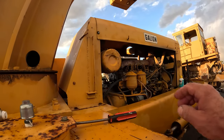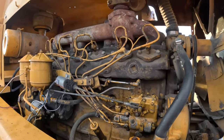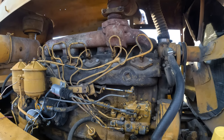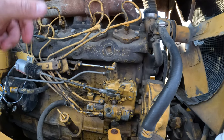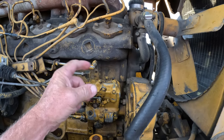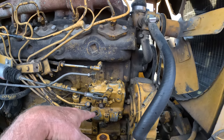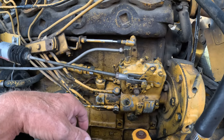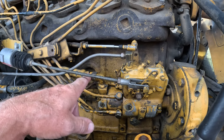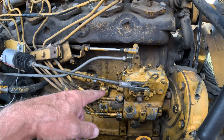I've spent the better part of the afternoon trying to get my crane running. Been talking to Frank on Signal - that's a cool app. Can't get any fuel pressure to come out the lines. Took the cover off and checked the metering stem - it moves freely in there. Just not getting any high pressure. Thinking about undoing this hose and figuring out some way to hook another hose to put some really high pressure fuel into this vane pump.